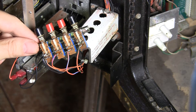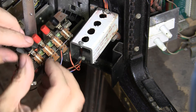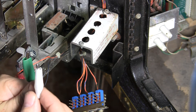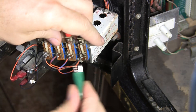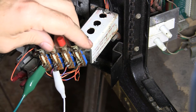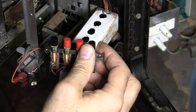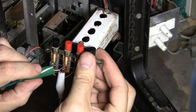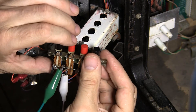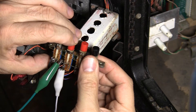The way you can check to see if the switch is working properly is you can take a meter and set it to continuity. I've put alligator clips on it — two alligator clips — and you connect one end to the central wire that goes all the way across in the middle, then connect one to one of the lower wires. Turn the meter on, make sure it's on continuity, and then when you press the button you can check continuity. I'll connect this to the middle bar here, and when I press this button — hear it squeak — you can see how flaky these switches are. Watch when I hold it down: hear it kind of stop and start.